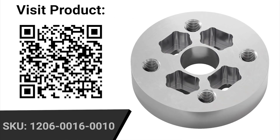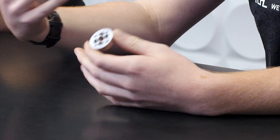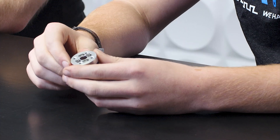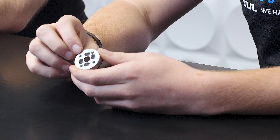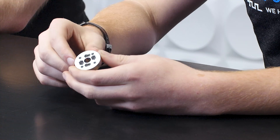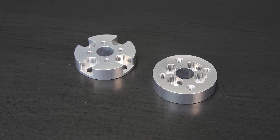This next option is a little more complicated. It's got M4 tapped holes on the Gobilda 16 millimeter grid pattern, and the Rev side has some slots. These are a 5.5 millimeter hex counterbore, allowing you to capture nuts or hex head screws, just like the 7 millimeter ones on the last pattern adapter, but they are slotted from a 16 millimeter across pattern — from a 4-repeating pattern to a 6-repeating pattern. Both are used in the Rev Robotics ecosystem. If you have a part with a 6-repeating pattern, you'll catch 4 of those 6 bolts, and with a 4-repeating pattern, you'll catch all 4 with the other side of the slot. These are very nice, usable parts and allow you to grab more parts from your arsenal for building your projects.